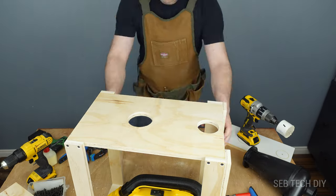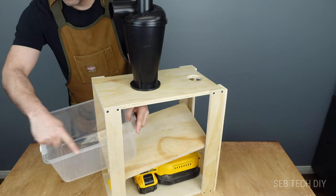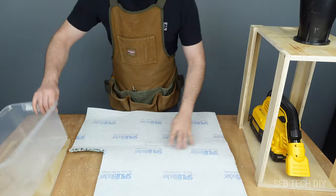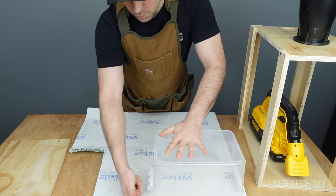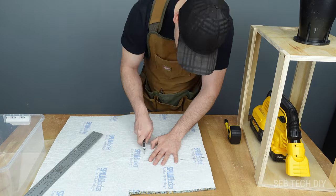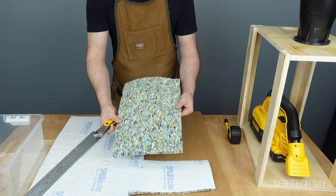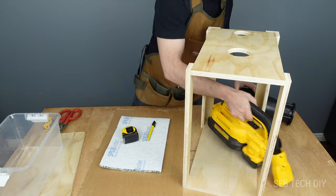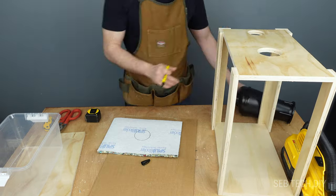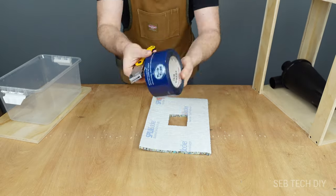There will be a middle shelf to hold the dust container in place, but that dust container needs a seal all around the top. To make that seal I'm using a piece of under-carpet foam. When I put some pressure over the bucket it makes a tight seal all around the top. The piece I cut using a utility knife is about half an inch wider than the top of my container. I also need to cut an opening in the middle to allow dust to fall from the dust separator into the container. This hole won't affect the seal so the shape doesn't matter.